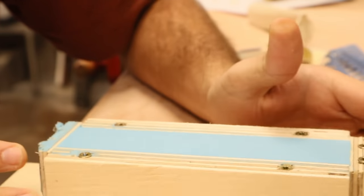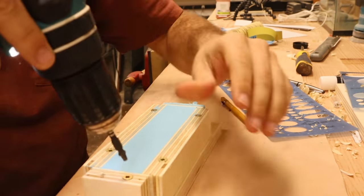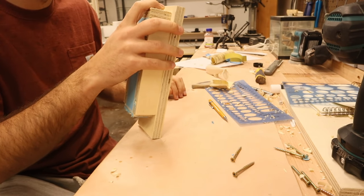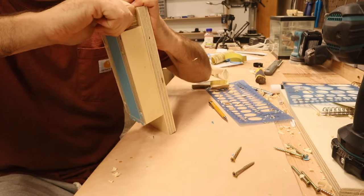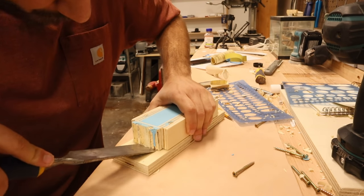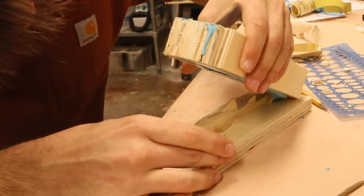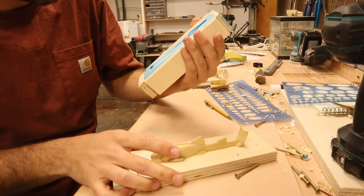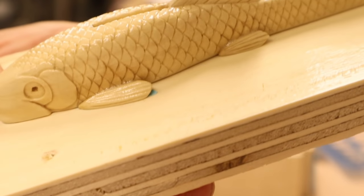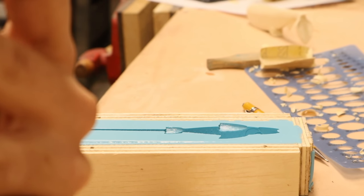We have finally achieved full cure — or demold cure, or whatever you call it. It actually takes 12 hours to fully cure, but you can demold it in three. I think pulling it straight off the back here is going to be most effective — I don't want to ruin this box in case I need it again. It cracked off. Oh, that is a beautiful, beautiful seam line! No chunks left. We lost a little bit of silicone to the master just behind this fin, but that is not a big deal — I can easily fix that.